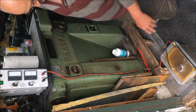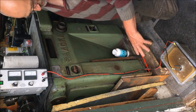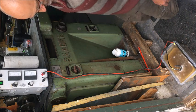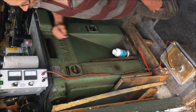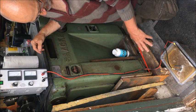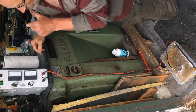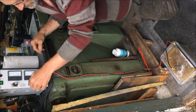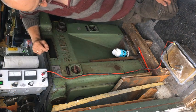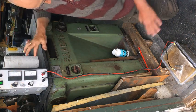This is sort of okay for a short time, with good ventilation, because you produce some flammable hydrogen gas. At least it is a really powerful method for de-rusting. And if I wanted to use the current limiter and limit it to, say, 2 amps, I can do that. So this kind of power supply is nice to use.